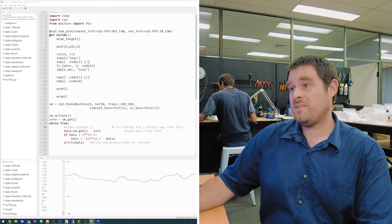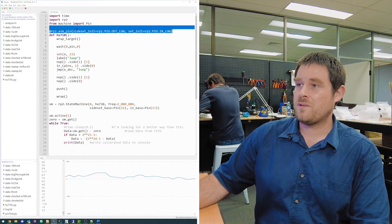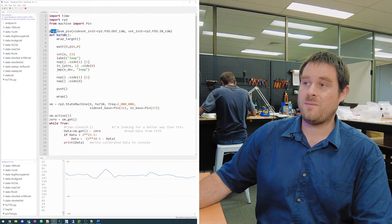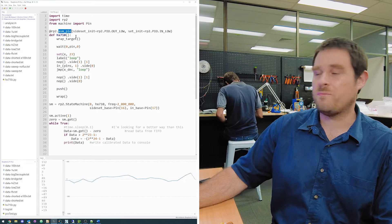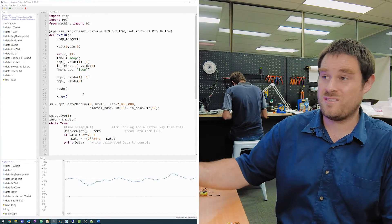The solution we're going to use is the RP2040's PIO state machine driver. In MicroPython, a PIO executable gets written as its own function with a decorator at the top that tells the MicroPython interpreter we want to use the RP2's assembly PIO module to interpret this code. This isn't Python — it's PIO assembly written to look like Python. This is the code that twiddles those pins in just the right sequence to extract 24 bits of force or differential voltage information.